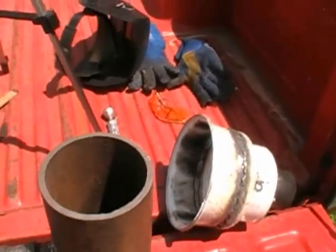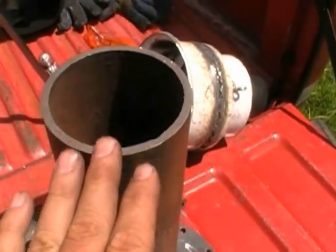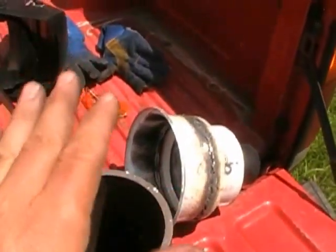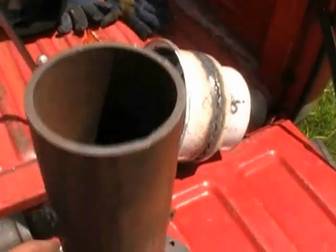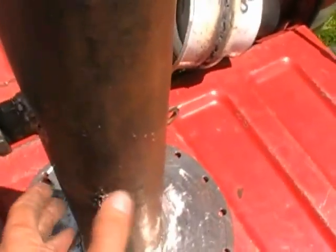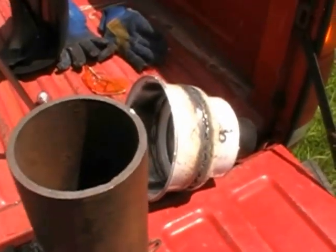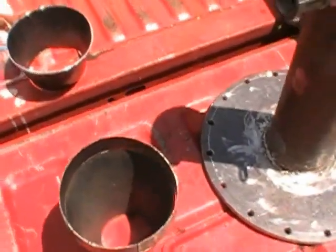One of the big reasons is, imagine you got fuel inside this thing. Just make believe this is the top of it, and you've ignited it and whatnot. You have a much slower air rate moving through the embers, because you got this big hole that's sucking the air down. It's downdrafting into the top of the ember bed, and so you don't really get what you call a raised temperature like you need, versus when you have an invert system.